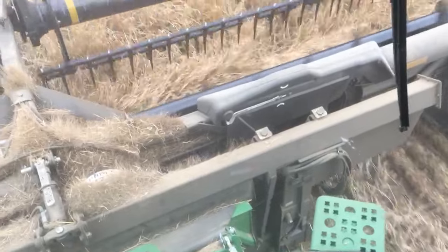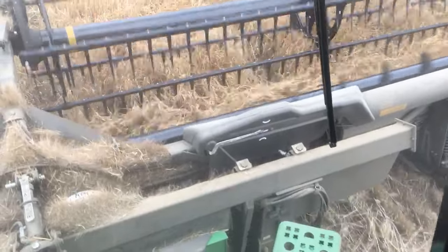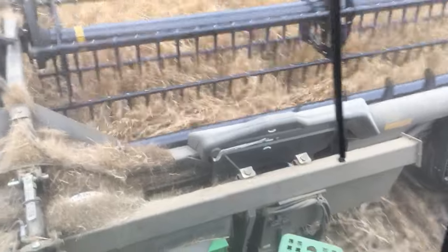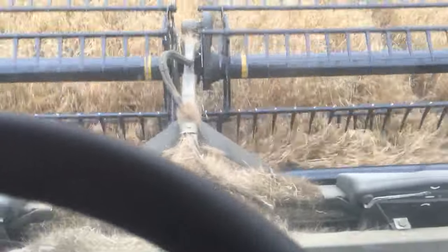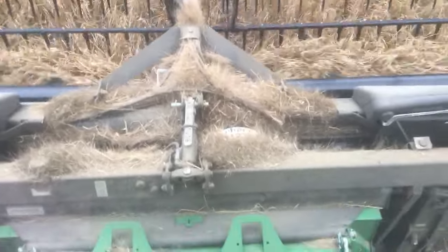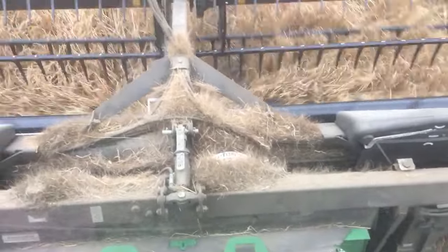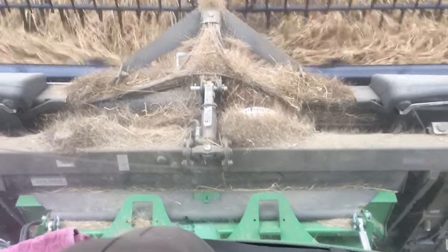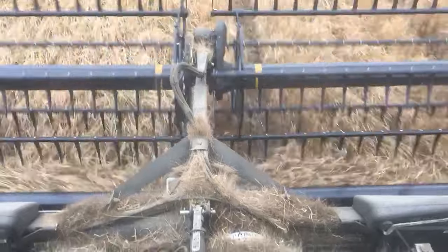And the right hand side is actually just sort of flipping upwards a little bit. You can just see in the middle of the screen there the sort of smiley face and the depressed face if you like. At the moment it's verging on flat and smiley, and on this side we've got slightly depressed, so that just gives you an idea of how it's actually moving along. Very easy to control the stubble height from up here. In the middle you've got the little ramp there, currently running on about B. If you want to increase the stubble you just hydraulically off-brake that and it just tilts the cutter bar basically backwards and forwards, and that's what sorts the stubble height out.